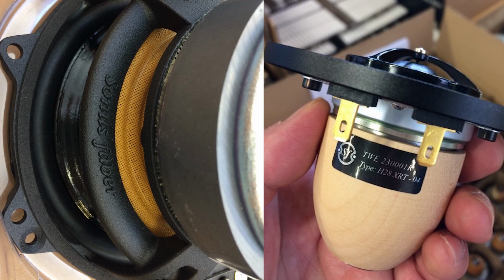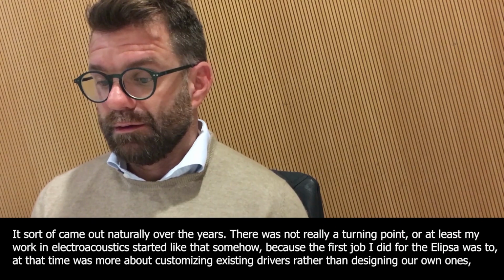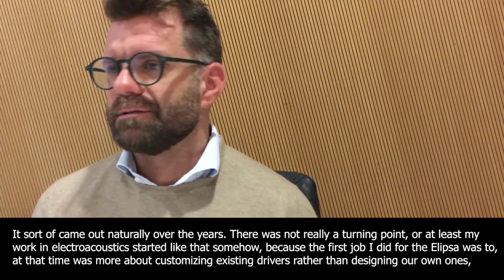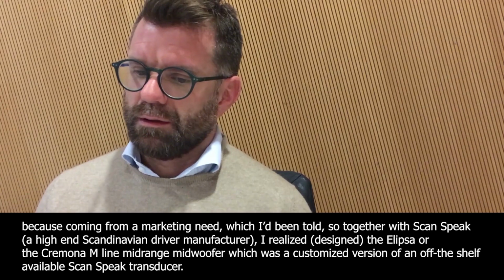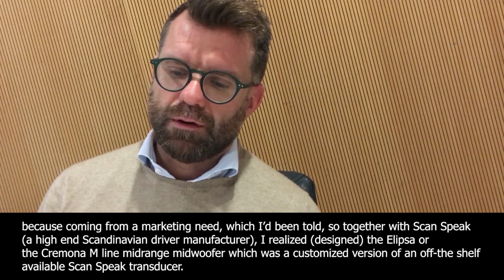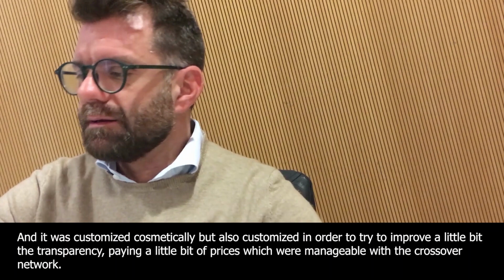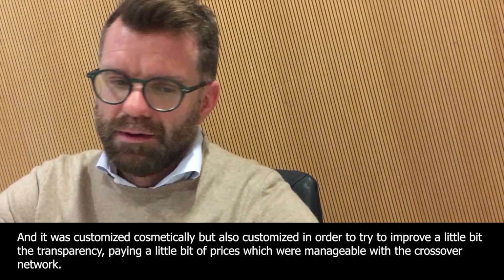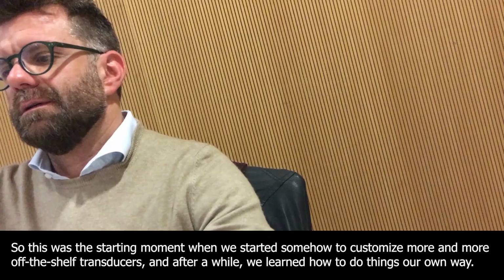Or at least my work in electroacoustics started like that somehow, because the first job I did for Sonus Faber at that time was more about customizing existing drivers rather than designing our own ones. It was coming from a marketing need, which I've been told. So together with ScanSpeak, I realized the Cremona M line midrange midwoofer, which was a customized version of an off-the-shelf available ScanSpeak transducer. It was customized cosmetically, but also in order to improve the transparency a little bit, paying a small price which was manageable with the crossover network. So this was the starting moment when we started to customize more and more of the transducers.